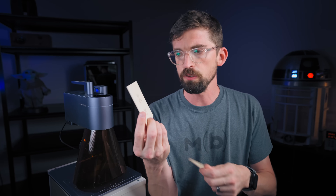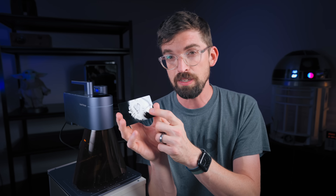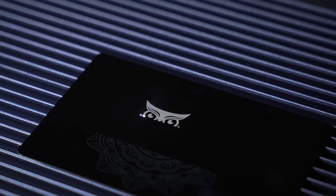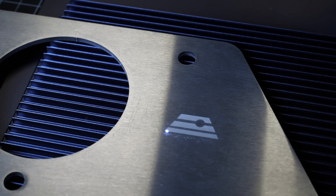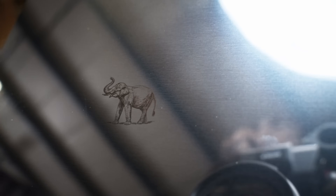I did a few quick tests — logos on cards, and a picture of my daughter in a bear outfit. These aluminum cards have a coating on top that you remove, which you can do on pretty much any laser. But what you can't do on other lasers is engrave raw aluminum — I engraved a part for R2-D2, specifically his foot with a label, directly on bare aluminum. I also engraved on stainless steel, which is very reflective and hard to show on camera, but the engraving is there. This applies to non-coated steel and other metals as well.